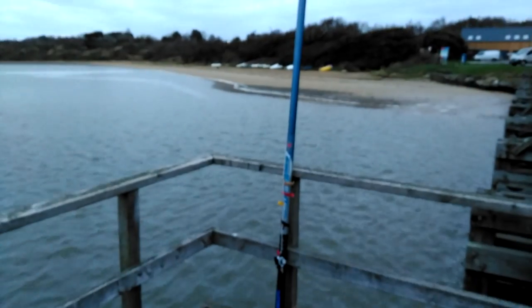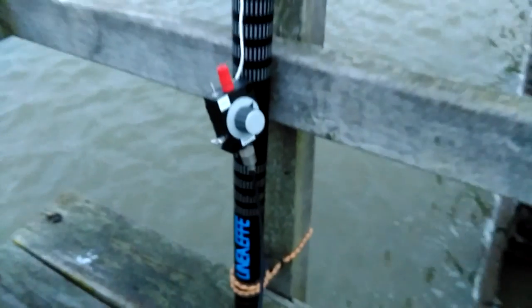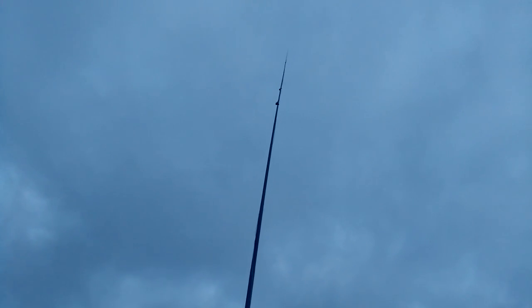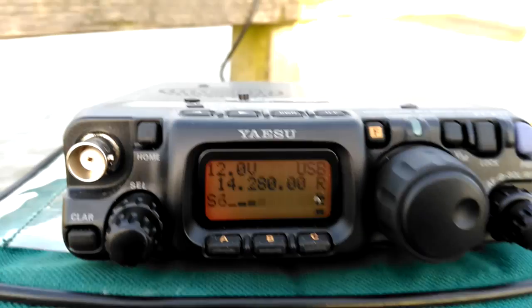All of the inductance removed, antenna is up in the air and ready to go. We are ready to go for the grey line, tuning in. We have a very small tuner and the traps that we already made earlier in the video are up — just 2 of them up there. So we can work 15, 17 and 20 meters this morning.